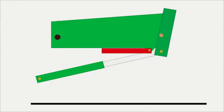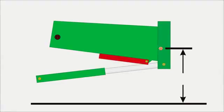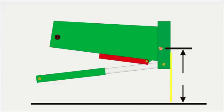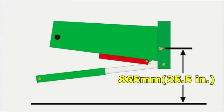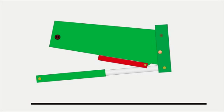The geometry of the feeder house, lift cylinders, and fore aft frame results in the feeder house height changing when the frame is tilted. Calibration instructions may call for setting the front frame pivot pin to ground dimension of 865 millimeters or 35.5 inches with the frame face perpendicular to the ground. Instead, set the height to 1016 millimeters or 40 inches in full forward tilt. The 865 millimeter feeder house height should be observed when the frame is moved to the zero or vertical position.